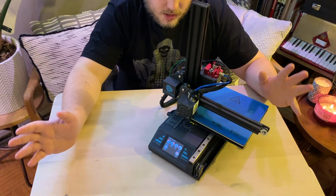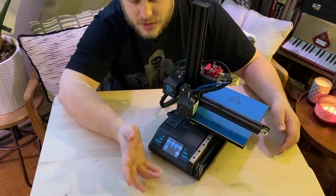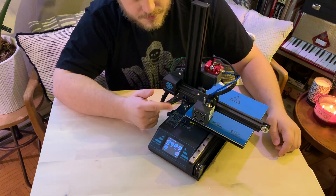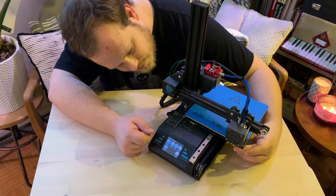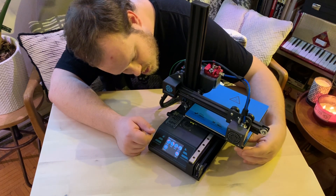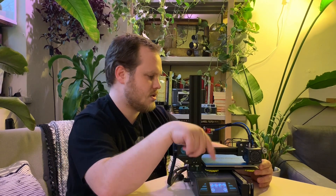In this case it looks like it's perfectly fine. I've already squared everything up here, so unless something's come out of whack, this should be a fairly straightforward process. The next thing we're going to do is press point two and it's going to move the head along the X axis. I can actually see it's come up a little bit, so I'm going to add a little bit of bed height there, just a tiny bit. You can usually eyeball this if you're patient enough, or just run a quick leveling print — we'll include a link for that file down below, which is just a single layer that will tell you if your bed is level.